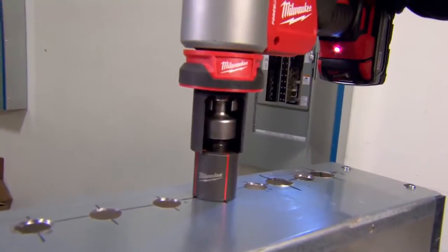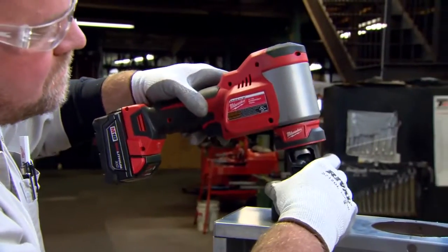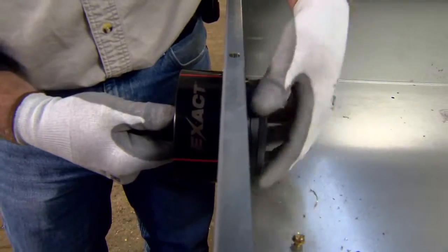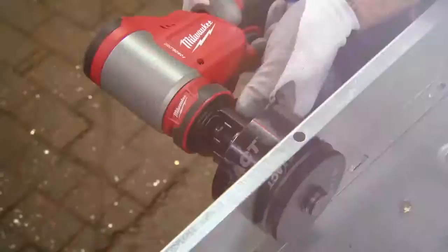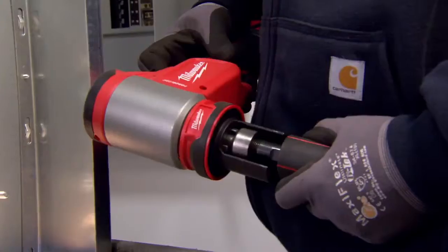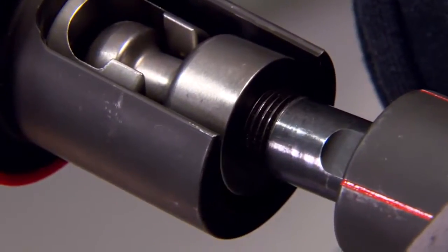Hence the name, it's Quick. It's light. It's easy. There's nothing to it — there are three pieces. You can put it all together up in the air or on top of a panel, and then slip the actual tool on when you're ready to do the knockout. I don't have to hold 15 pounds of a hydraulic pump and try to thread the die on the inside of the can. Production is faster with the Quick Connect because you're not holding all the weight of those hydraulic heads.